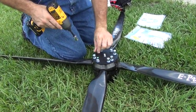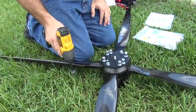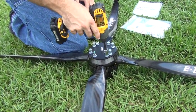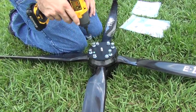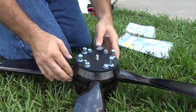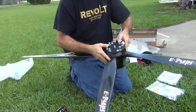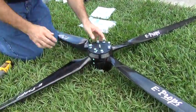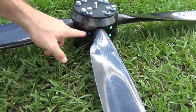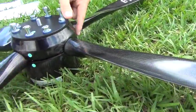Four of these bolts go all the way through and hold the propeller to the engine. The other four actually go through to the other side of the hub. So there's our four that hold this together. Now what I've done is I've made this a complete unit that we can pick up. One of the things you've got to watch for is it's very, very easy to get the hub to where you have a ginormous gap on one side and basically no gap on the other side.